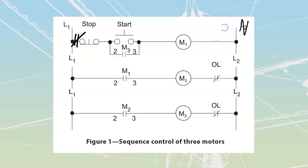pretend like that's a line all the way through there. Any sort of a ground on the system at that point would not continue to cause this thing to run, right? Obviously, if I ground here, it's the exact same thing as having my neutral grounded over here. If I had a ground over here, that's just going to go and short circuit this one because I got no load in there anymore, and it's going to go and kick this thing out. We're back to being safe.